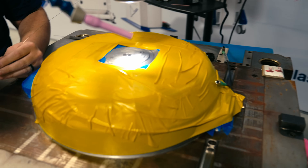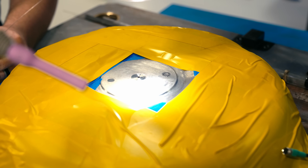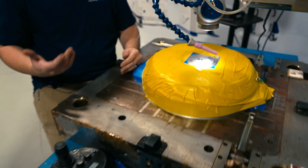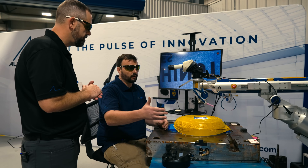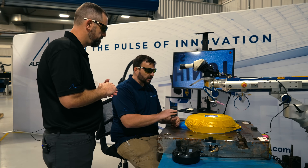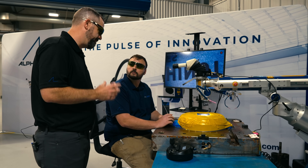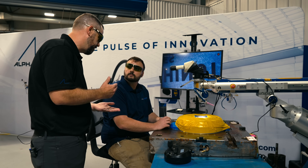The other thing we're going to be showing in this video — we're going to weld this up to the point where we can hand bench it off, so that way we don't have to take this and throw it back in a CNC. We're going to weld it up, move it out from underneath the laser, and then stone off all the weld. You'll have just enough buildup where they don't have to reset it in a CNC — they can hand work it with a stone or a grinder.